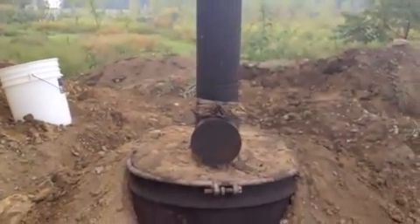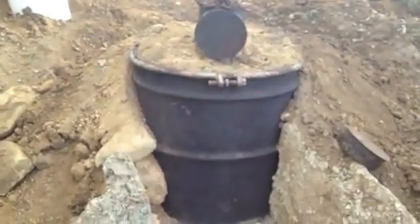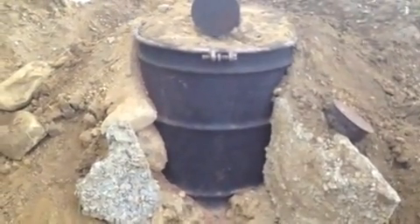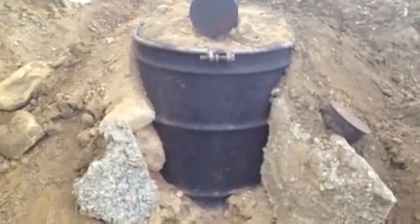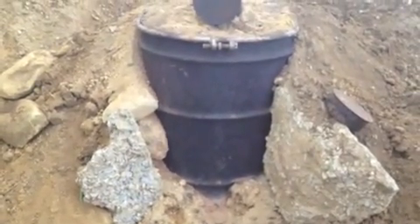You could also wrap it if you don't have a giant pile of dirt like we do. Vermiculite is a great insulation, as is fiberglass. You will want that insulation around that 50-gallon drum to ensure that the heat is staying inside to get the inside of that 30-gallon drum up to the point where you're beginning to drive off those hydrocarbons and volatile organics, so you can create that nice flame on the bottom and get that perpetual flame going.